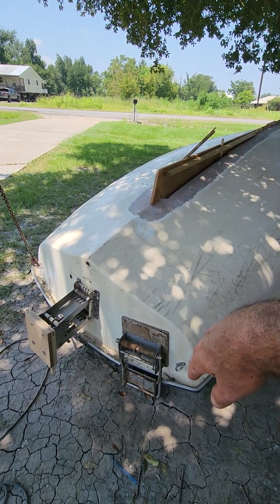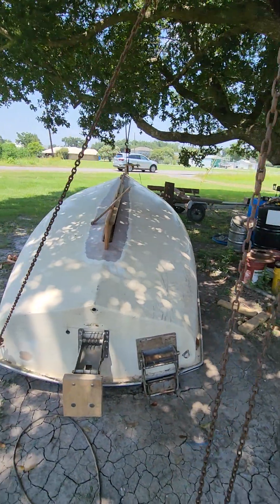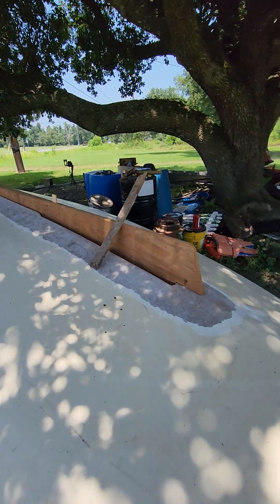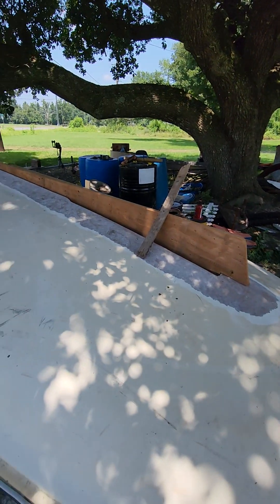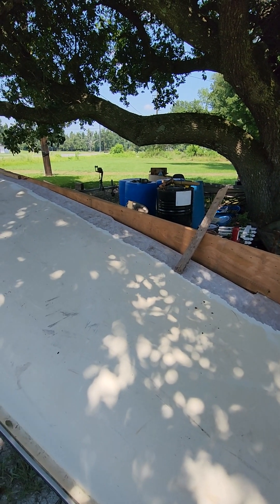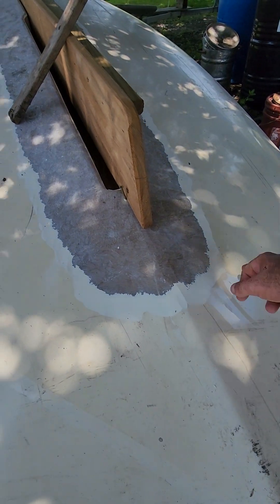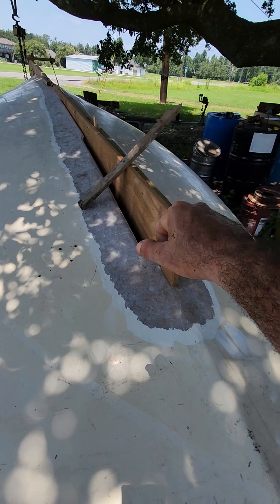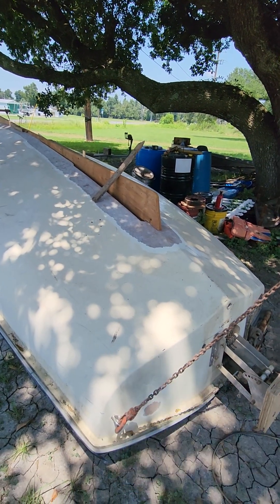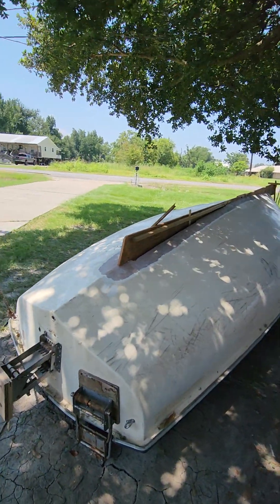Since it's going to be a tugboat, we're considering putting a round radius in the back and going inboard — either a traditional shaft and rudder with an air-cooled inboard or a little diesel engine. You sacrifice cockpit room if you go inboard. If I go outboard, you've probably seen boats with a box where you drop the outboard in, use a traditional outboard, and you can hide the outboard under a rear deck. That's an option as well.